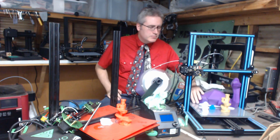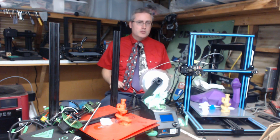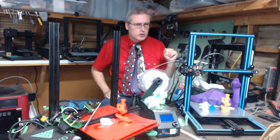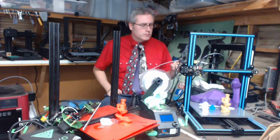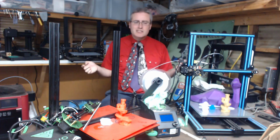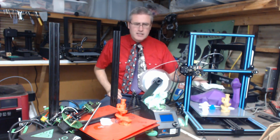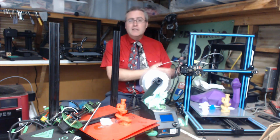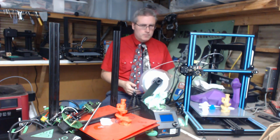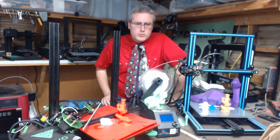And yeah, I'm really enjoying playing with the CR-10, but I kind of hit my first snag. The glass bed, which I had coated with hairspray and done up just the way you're supposed to with hairspray, which again, safety first when you're using hairspray, especially around 3D printers. But for some reason it wasn't sticking anymore, and I suspect it's because it's so dusty in here. So I'm gonna play with some other build plate options to get it to stick on here. But I'm having successes. Even in my failures, I feel like I can manage them. But with the Tevo, I am still at a loss as to what the problem is.